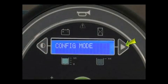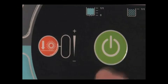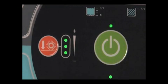The supervisor control button is used to access the configuration and diagnostic modes. Only properly trained service personnel should access these modes. The large green button in the center of the control module is the one-step scrub button. Pressing this button turns on all scrubbing systems that were active the last time the machine was used. Note, there may be a short delay before all scrubbing systems are activated and the indicator light turns on.